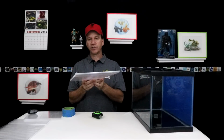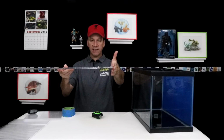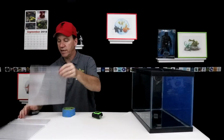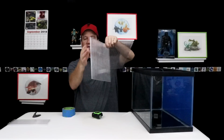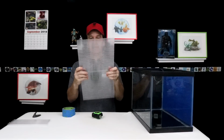So the cool thing is you've already got your table saw set where you made this cut at 9 3/4. You simply turn it this way, cut that at 9 3/4 again so that you have this piece, and then you turn it around and you cut this piece at 9 3/4. And so when you make that cut, now what you end up with is these 2 pieces, okay? Again, we've got that rounded edge here, and we've got that rounded edge here. So now we've got this piece that goes like this.